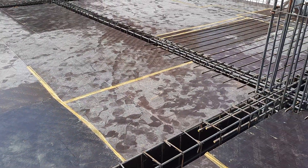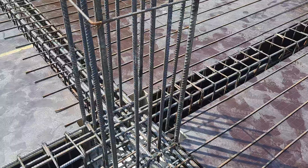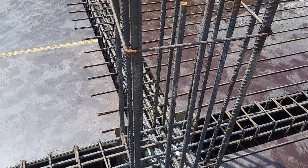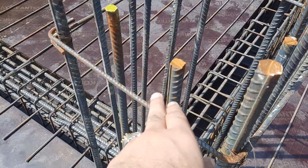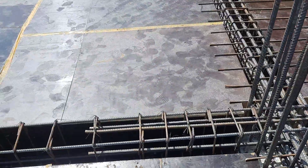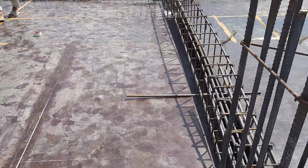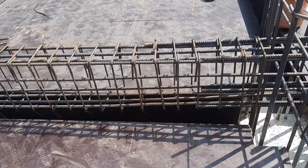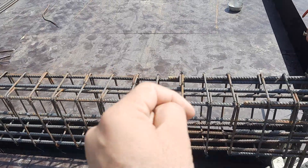This is the column, which is 24 by 24 inches. With concrete cover, you can see the steel reinforcement — we have 12 numbers of steel rods. You can see 25 mm, eight-number bar, 16 mm, and 20 mm bars used here. They used 60-grade steel rods in this construction. This is B2, which I have already discussed for its size, bottom steel reinforcement, upper compression zone reinforcement, and stirrups details including extra steel rods.